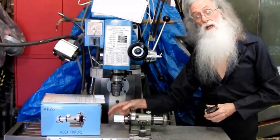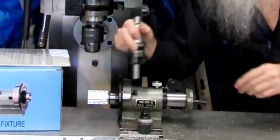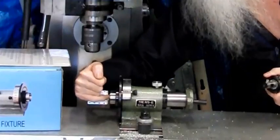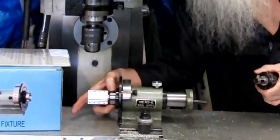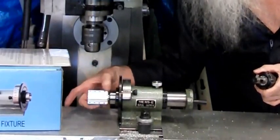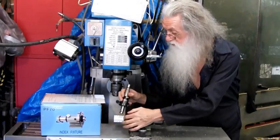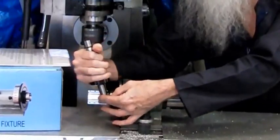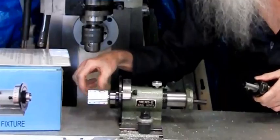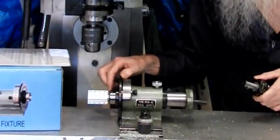Then you have to allow for the cutting clearance. And when it comes in the cut, it will take a cut, so it will spin around. And here is your collet, extremely small neck, excellent. But on the smaller ones, especially even below, say, 30, or even below 40, you'll hit the chuck. You'll hit the actual jig. So you have to stay back. So I add extra material, 5mm there, and I've got it hanging out of the collet by roughly 5mm as well.